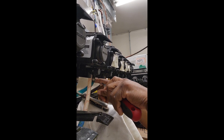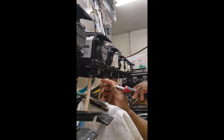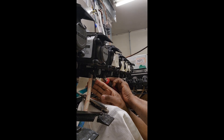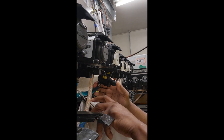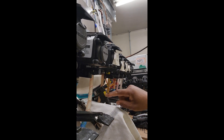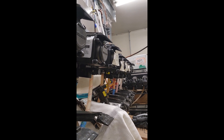I've got the line clamped a little bit just to cut down on syrup leakage — there's going to be a little bit of leakage changing these out, but I'll try to minimize it. I'll grab my cutter, cut that line, and then reconnect it to the new one with some clamps.